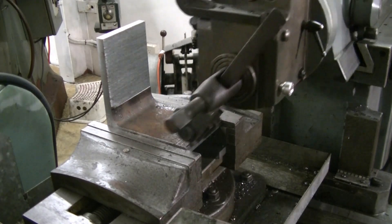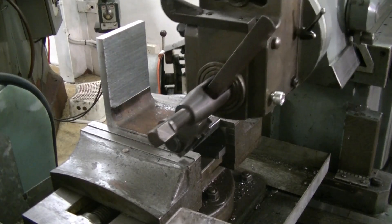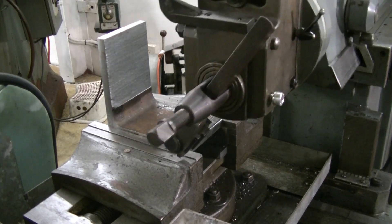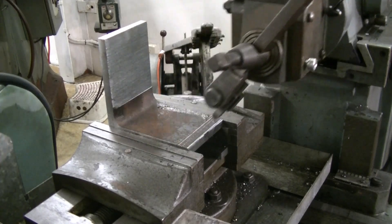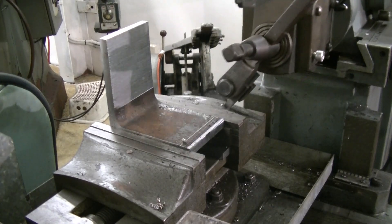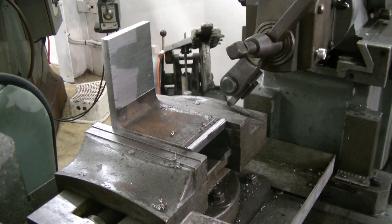It's just touched off there. Put a bit over half a mill, and set the feed in the right direction. I've put a bit of cutting compound on there — I don't like using fluid if I can get away from it; it just messes everything up and you've got to clean up afterwards. Now as I'm coming in from an edge that's already been milled, it's underneath the mill scale right from the start. Another reason I like the shaper is the box around the vise here collecting all the swarf — there's very little clean up to do after the job.